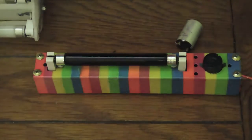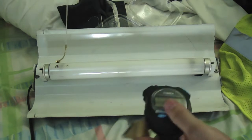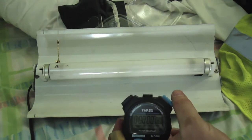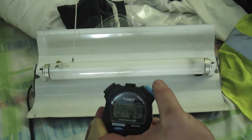Alright, now we will do it in the 14 watt light. The pulse starter is installed in the 14 watt preheat. Remember all the blinkity blink blink blink we got out of this tube? I like blinkiness but some people don't. So let's watch how this starts with the pulse starter. See it comes right on, and it took about the same amount of time but with no blinkity blink blink blink blink.